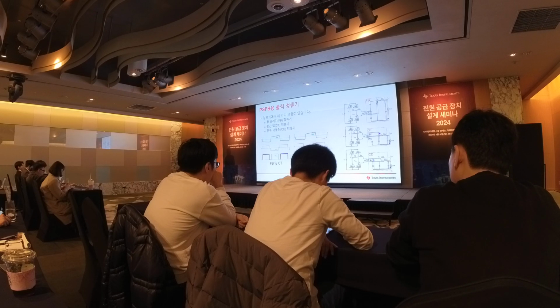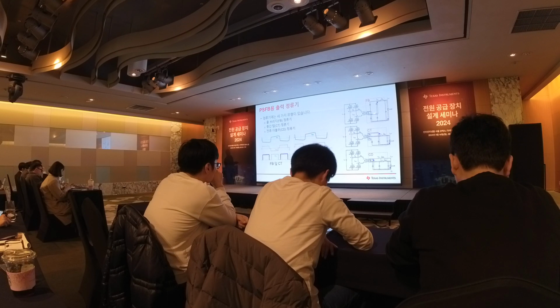So when VAB is positive, we also apply a negative voltage here to the second winding. For full bridge rectifier, there will be this diagonal pair conducting current, and in center tap there will be one of the output windings conducting current through the inductor, and for current doubler it will be only one inductor conducting current through the output winding and diode.